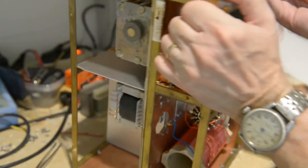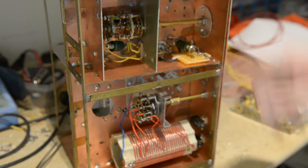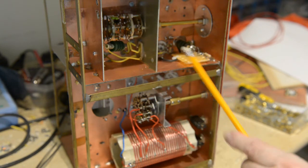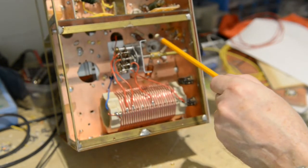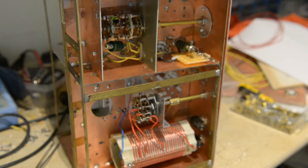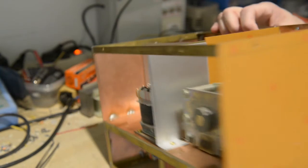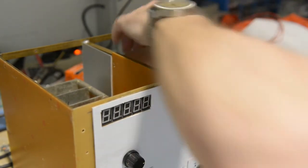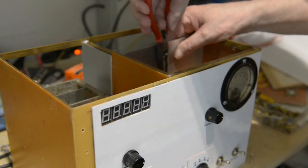Okay, now I put in several things, and I'll show you. As I said, I put in the coils, the coil for the screen grid and the coil for the anode. All the connections are there. I made the connections and the parts for the end stage plus the choke, and everything is there. So that's what I've done. Anyway, chaps, it's coming along. You can see the first transformer's in. I have to be very careful. I have no connection on the back here. I see that already, so I have to get this right straight away.